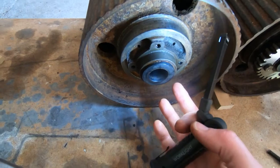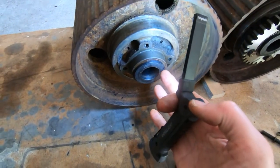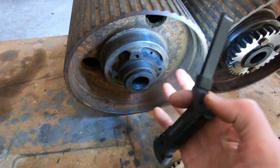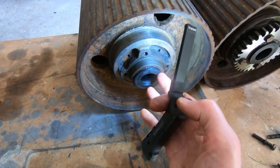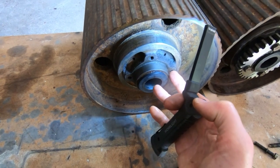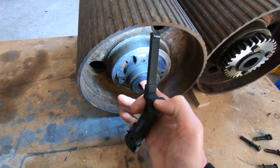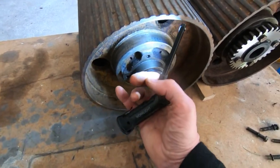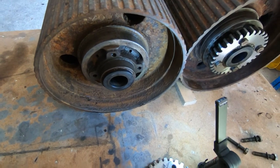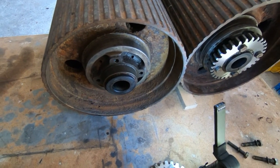I think what's happened here, and the shaft won't go in, it took 6 tons of force to press the second roller off the shaft using the hydraulic press. And it won't go back in. Now, despite cleaning the shaft and the bush, it just will not go back in there. And I could press it back in, of course, but that would defeat the point. It still wouldn't rotate freely. I think there's rust and corrosion between the bush and the roller itself. And I think that's caused the plastic of the bush to be compressed inwards. I've measured it, it's only about 0.2 millimeters, but it's enough, because it's quite a long bush, it's about 100 mil long, and that's enough to grip onto the shaft and stop it rotating. I could of course replace the bushes, they're easily pressed out, but I don't want to spend £200 on what's a fairly old mower anyway, unless I really need to.